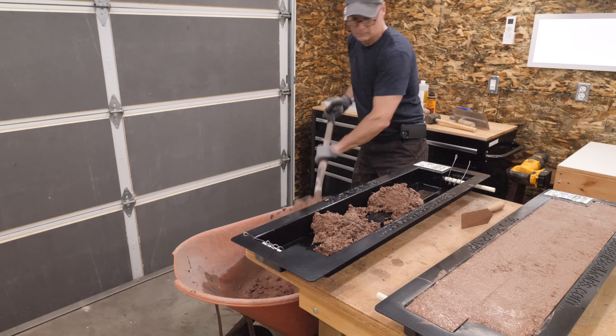I gave the concrete a spray with water before covering them back up with plastic. Two days later, I unmolded the vermiculite castings. With the mineral oil prepped molds, I've been getting some trapped air on the surface, so I was hoping the wax treatment would eliminate that issue. The 36-inch ones looked really good — I was happy with the color and surface finish. After some gentle persuasion, the 24-inch panels came out as well, and I think they look great with a really nice finish.